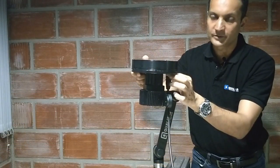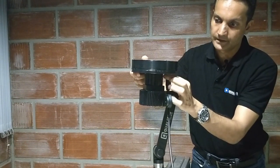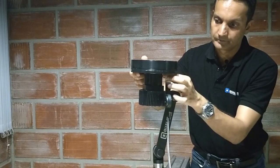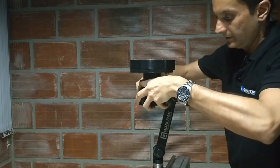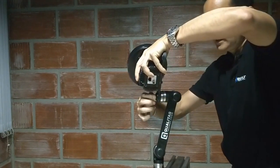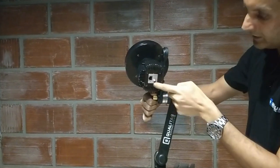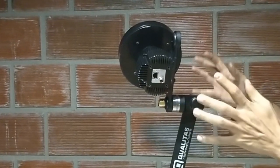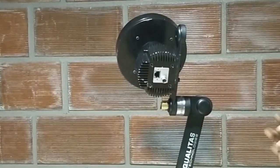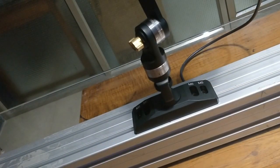As you can see, the camera comes with an integrated light, which I can easily remove from its connector. The camera connections are equally simple. It comes with a standard ethernet port along with a Hirose six-pin trigger as well as power supply. That's pretty much what you need to connect your camera to an assembly line. The arm is mounted to a profile using either an M6 or M5 diameter locking mechanism.